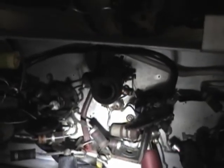I've also come across quite a few where they had doubled up resistors. Like there's a couple 180Ks in series up there, a couple 33 ohm in series down here, and those are the original. I think that at the factory they just didn't have the right values. I think that's supposed to be a 68 ohm. Instead they doubled up two 33s to make a 66. I'll be replacing that with the value indicated on the schematic. And shortly we'll see what difference this makes.